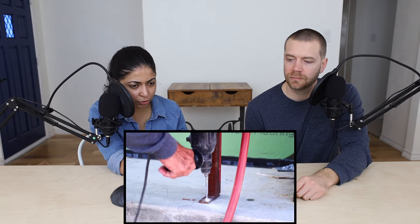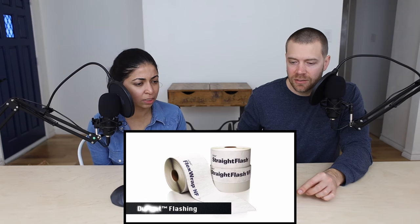When applying Tyvek to your house, you use staples or nails — specifically cap nails, which are nails with a cap around them. The cap has ridges that make the fastening airtight to prevent water intrusion. Looking at this graphic, the fasteners are spaced about 12 inches on center, and DuPont specifies exactly what the spacing needs to be in order to keep the warranty. That is a lot of penetrations, which raises the question of whether you're compromising the air-resistant and weather-resistant properties of the material.